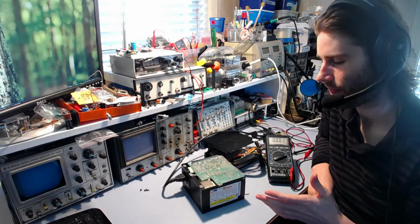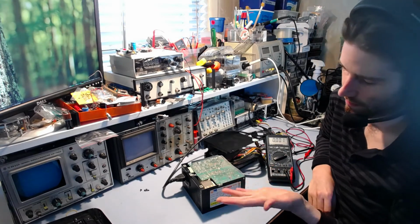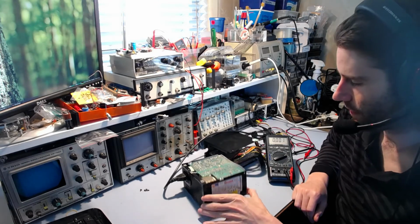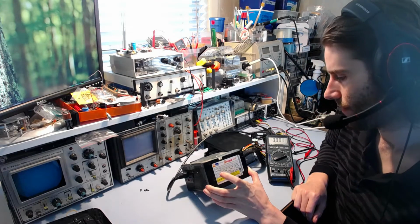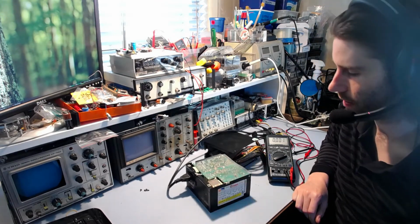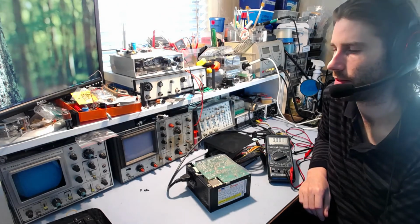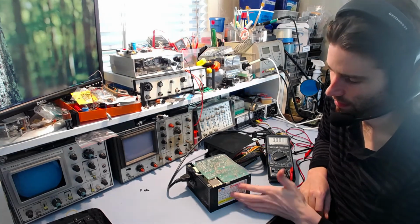Anyway, this power supply is out of a computer, obviously. It's a computer power supply, ATX, an AcBel Power 510, model PC7013. It's a passive PFC one. It's got a big PFC coil here, which I quite like. You know, the active PFC power supplies seem to blow up more often, but anyway, this one has blown up anyway.